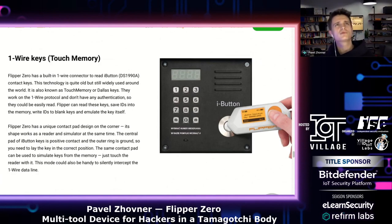I want to talk about how we started development on Flipper. First, I thought about making a shield for the Raspberry Pi Zero, like a Pwnagatchi. But during development we faced difficulties — the Raspberry Pi is a quite old platform. It's very power-hungry and doesn't have sufficient power management options like sleep mode. After this failure with Raspberry Pi Zero, we decided to develop our own board from scratch.